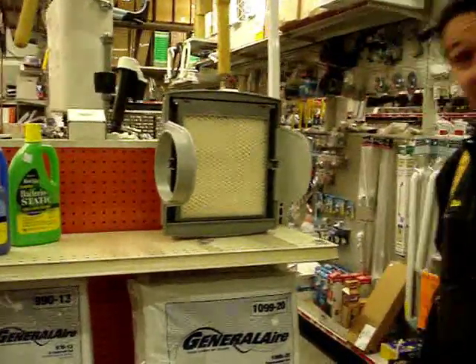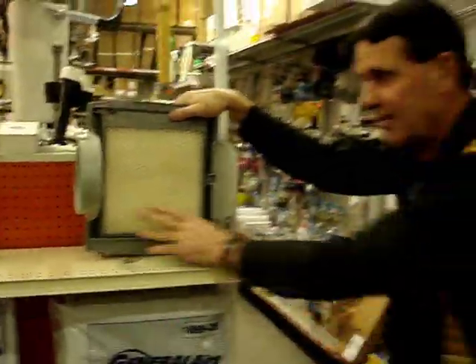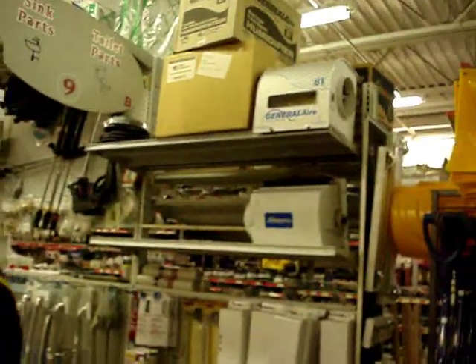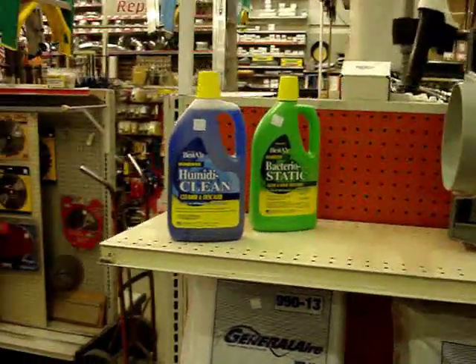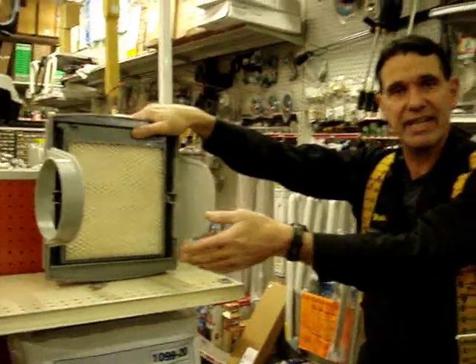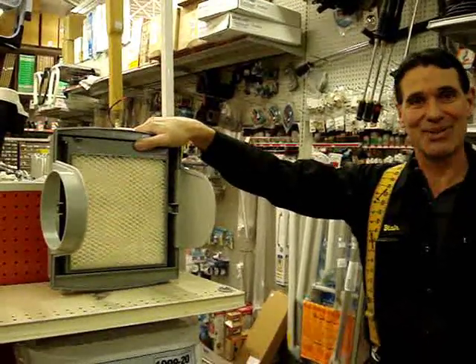That's the story of our humidifiers — you keep these babies clean. You now know that they're low voltage feeding most of them. There are old ones that are fed with 110 volts, so you really should not be going into your unit unless you have full knowledge of the type of electrical power coming to it. But cleaning them, keeping water running in, keeping water draining away — a moist house is a happy house.